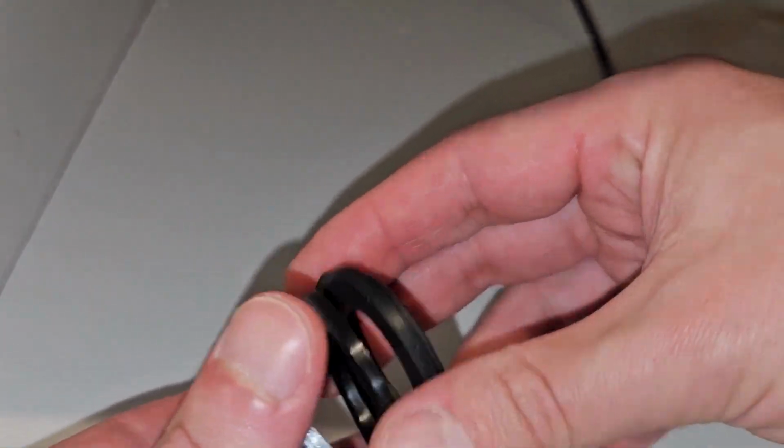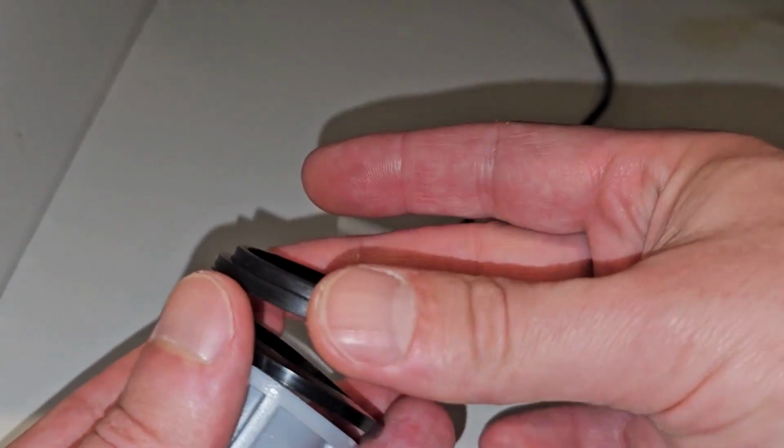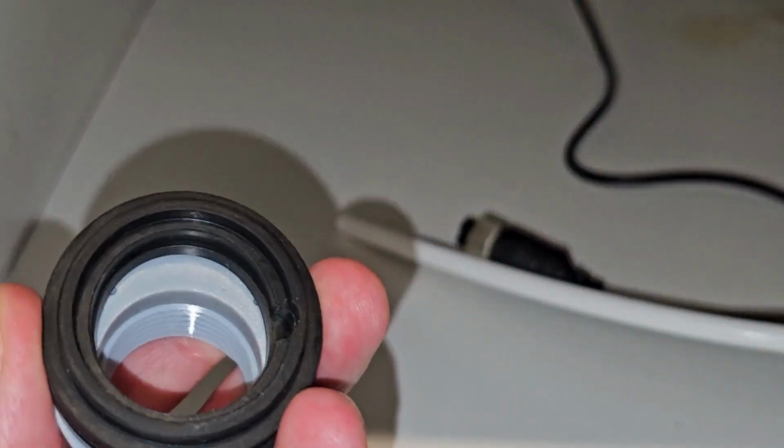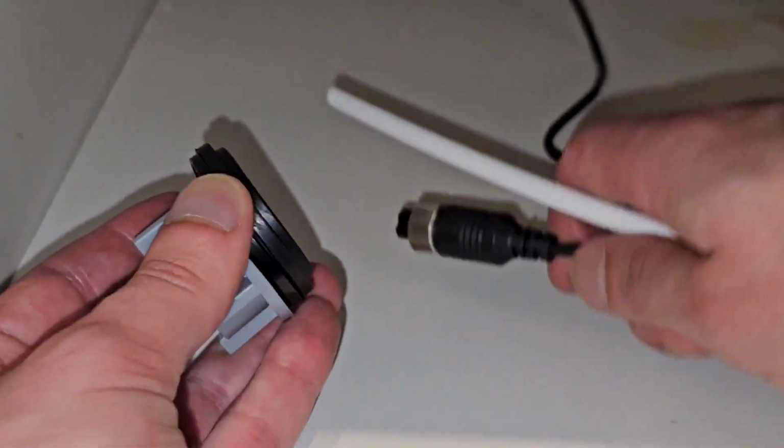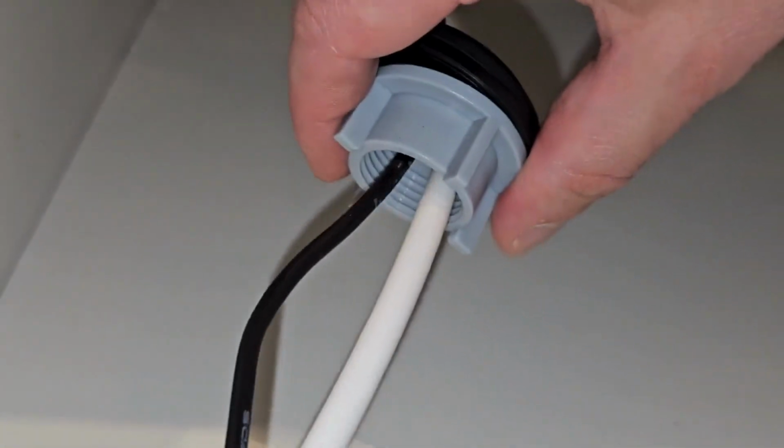So now you have 2 washers included. For this install, we made the mistake of putting both washers on the bottom. However, it still worked just fine, but you should have 1 washer under the faucet above the sink and the other washer underneath the sink on top of this gray collar. However, we did it with 2 washers on the bottom and it still worked just fine.